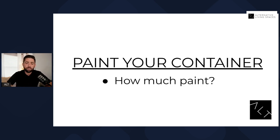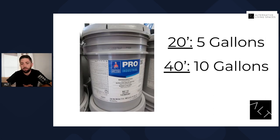When it comes to quantity of paint, you don't want to over-purchase or under-purchase. For a 20-foot container, typically five gallons of paint is plenty. If you're really good with a paint sprayer, you may only use three gallons. We're usually doing a couple coats of paint on the container. The number of coats can also be determined by colors — like if you have a really dark container and now you're trying to paint it a very light color, you may require two to three coats. For a 40-foot container, we recommend 10 gallons of paint. If it's your first time using a paint sprayer, you'll probably use the majority of that. If you're experienced with paint sprayers, you'll be more effective and will likely have some leftover.